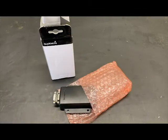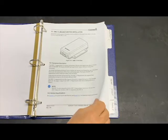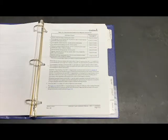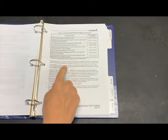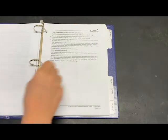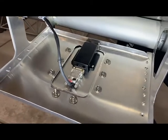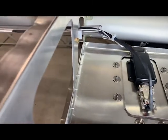Finding a location for the AHRS magnetometer was a little tricky and took a lot of planning with the tape measure. As you can see from the install manual, the requirements to find a magnetically quiet area are pretty stringent: 10 feet from any motor, 8 feet from any ferromagnetic structure, and especially in a wing, 3 feet from any control cables. And as electrical wires produce magnetic fields when current is flowing, any power wires in the wing must be a twisted pair, and ideally shielded, as I needed to do with the wing tip lights. But I finally found a location that mostly satisfied this requirement — mostly, as I couldn't get the full separation called for in the manual.